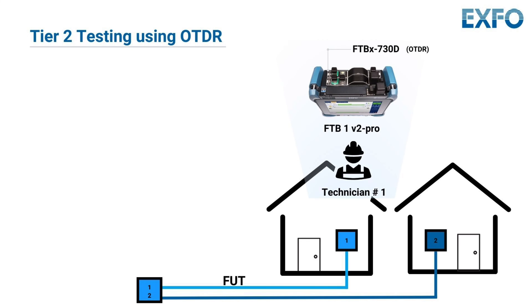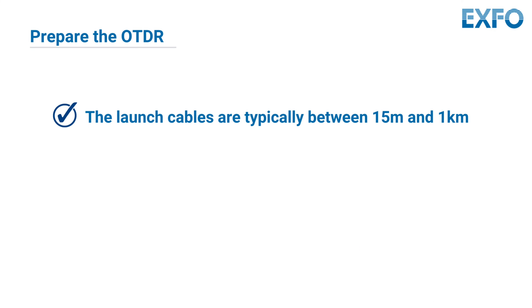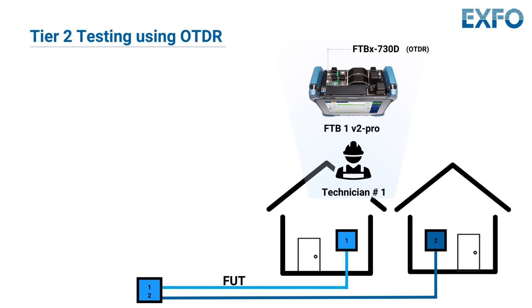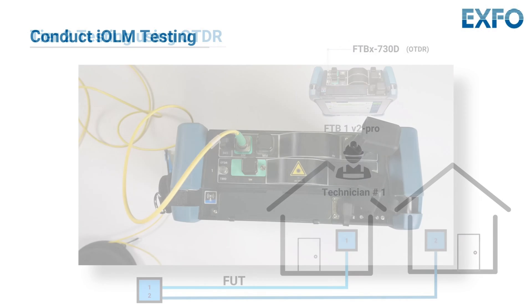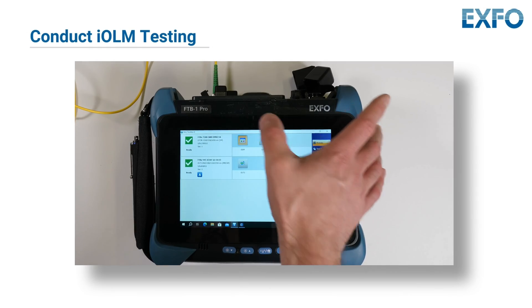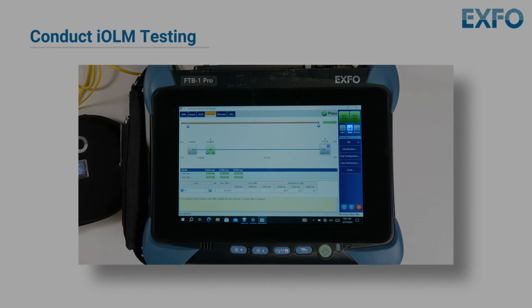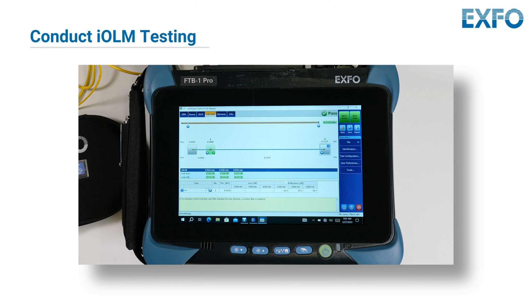As shown on the graphic, only one technician will be required. Gather the necessary cabling and connectors. We recommend the length of the launch cable is usually between 15 meters and 1 kilometer. Then clean all connectors following the same process used to prepare the OLTS units. Use launch fibers at the near end and receive fibers if needed at the far end of the fiber links. This helps overcome dead zone limitations and tests the loss and reflectance of the connectors at each end. Connect the OTDR to the launch fiber to test the link, then initiate the IOLM measurement. IOLM dynamically locates and identifies all network components and faults with maximum resolution. Store the IOLM trace data for future reference and analyze the results to make informed decisions about the fiber optic cabling system's performance and integrity.